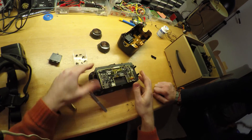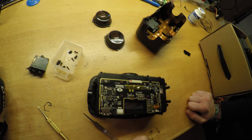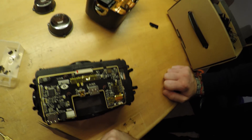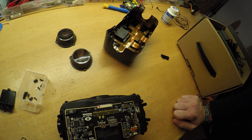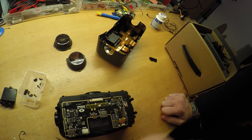Here is the main board. It has an STMicroelectronics ARM Cortex-based STM32L100 microprocessor on it, five LED driver chips in the middle, and in the top right corner there is something that might be a step-up converter because it has a big inductor in the middle.